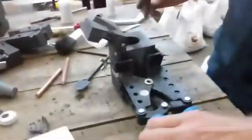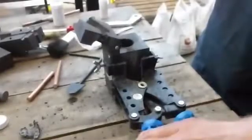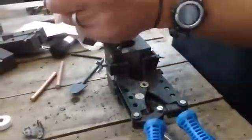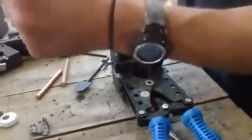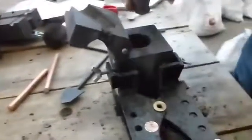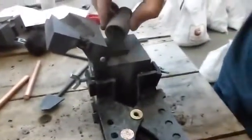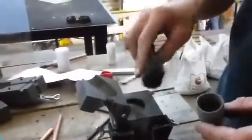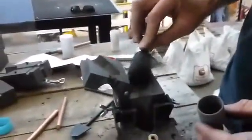According to the instructions, make sure the mold is clamped. Take your weld metal — remember it has to be the correct size — and pour it nice and confidently into the weld metal chamber.